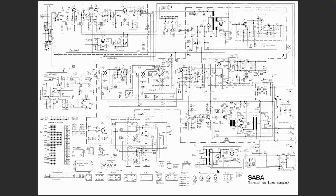We've got our transformers down here. We've got the connection to the car system over here. And yeah, auto antenna. This would be the car system. Going to the battery. Power supply. This is from the mains. There's your battery. It would all get switched in here. Power amplifier. It's got an intercoupling transformer over here. So it's driven by these two transformers. Sort of output transformers. This is interstage. This is the output transformer driving these two 8162s in push-pull.